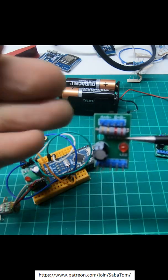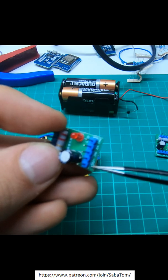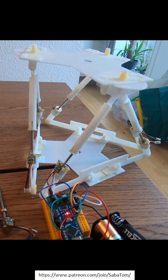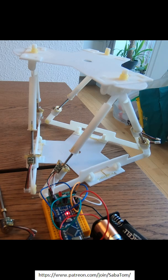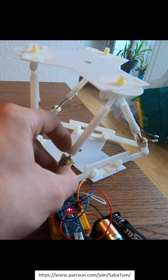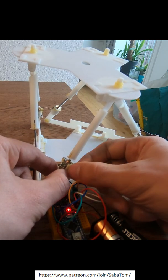The camera doesn't focus so well. There is manual phase shifting — plus 5 and minus 5, zero and plus 5 for the power supply, then enable, phase 1 and phase 2 active. Here is the demonstration of one leg being moved, showing off the unique feature of statically determinate configuration: you can move one leg at a time. I don't have the code for running all legs at once — it hasn't been fully tested. You can see the glue is actually melting due to the motor getting so hot, but it is not melting the resin, which is nice.